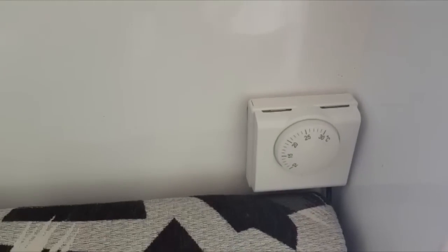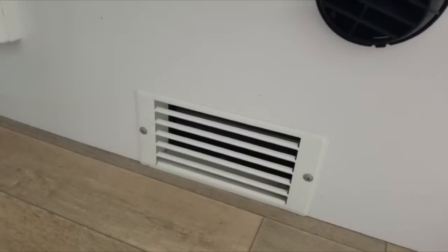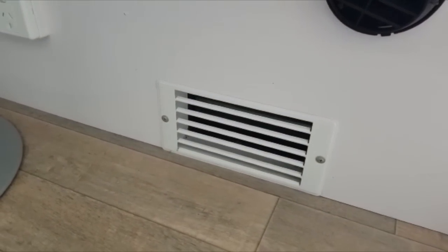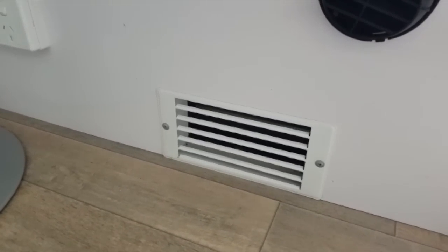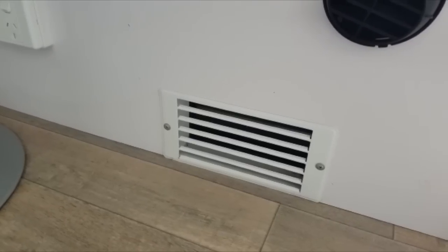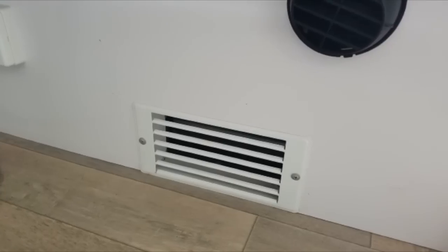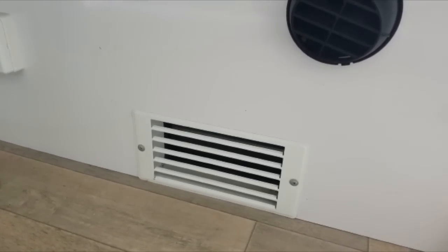I've got a thermostat hydronic heater which sucks in here and blows out there. All it is is a radiator that passes hot water through it, circulates it back to your hot water service, and a fan that blows the heat from that radiator out. I purchased this online — I think it cost me $550. If I built it myself I reckon it might cost $50. Next time I would build it myself.